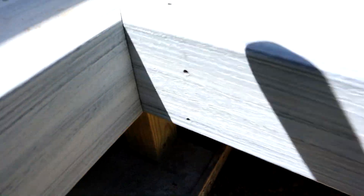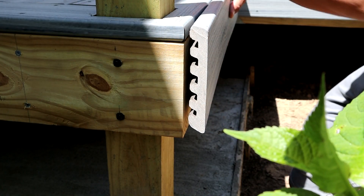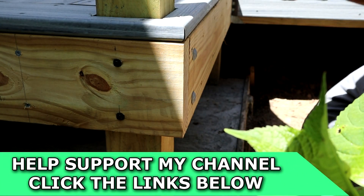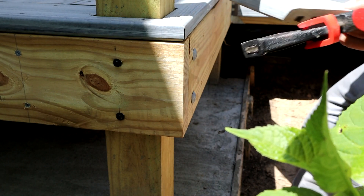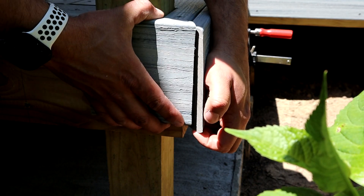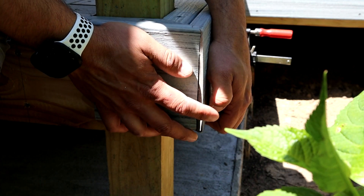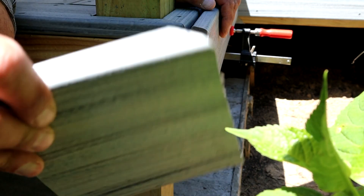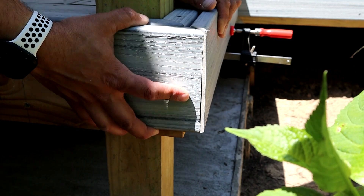Okay, that's what you're looking for — like that. This is going to butt into here. Now I cut this to rough length. What I want to check before I finish it off is that when this other board comes on the side, everything's going to meet nice. Because if you were just to measure to the edge of this and cut your 45, I guarantee it's not going to line up when you go to put the next skirt board on. So with that clamped on, just got to pull this thing flush and bring this guy in — this is a scrap piece — and you can see we're still quite a ways away. That's how much we have to cut off this board to get it to meet up nice. Just get yourself one of your scrap pieces like this and use that as a template as you're going around the deck — you can line everything up.